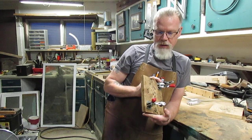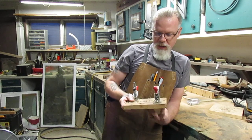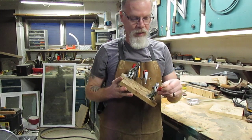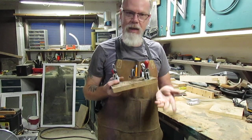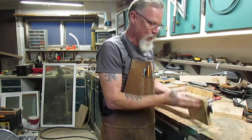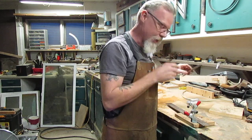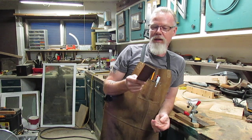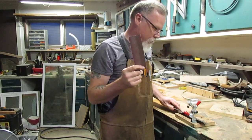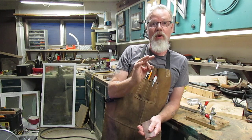This is my drilling jig that I use — it's about due to be replaced, it's got a lot of holes in it, but this is all you need. You can get these clamps from any woodworking supply. Just take your material, clamp it down nice and flat and square, and go to your drill press and do your drilling. The other thing is: as a knife maker you've got tons of belts, and I use old worn-out 120-grit belts. They do two things — they add grip, and when you're drilling handle scales you need to back them up with something so you don't blow out when your drill comes out the other side.